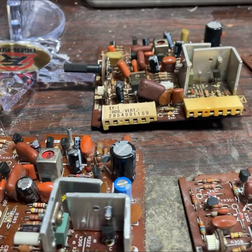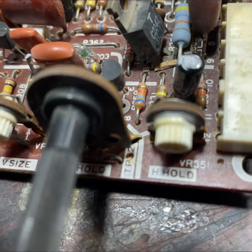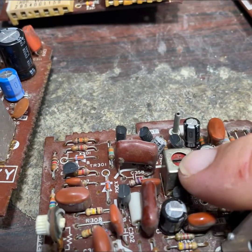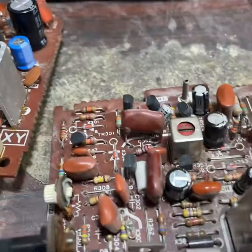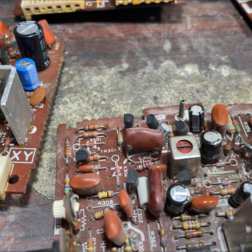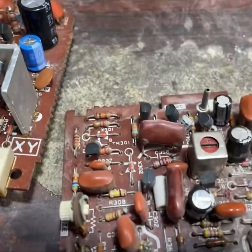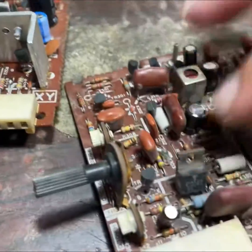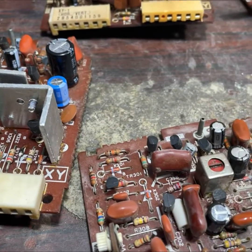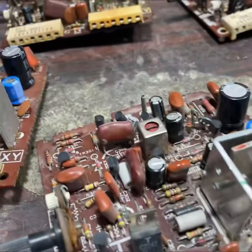Here's something a lot of people don't know about 4600s: you've got horizontal hold right here — that's the fine adjustment. You also have another horizontal hold right here that'll give you more range on your horizontal. If you turn it too far one way it'll just shut down the monitor, so turn it back, fire it back up, and usually you can find a sweet spot where it'll sync nice and work fine. If you have a horizontal hold problem and this pot isn't syncing, there's probably something else wrong in the horizontal.